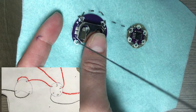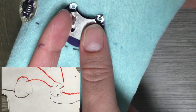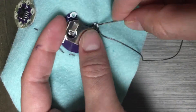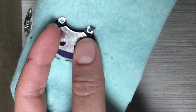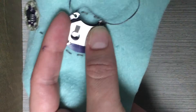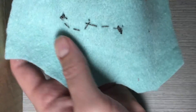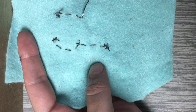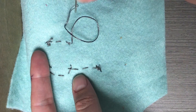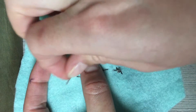Next, look at your circuit diagram — it's a good time to sew on the negative ends of the battery pack. In my diagram, the battery pack is not directly connected to the microcontroller on the negatives because I'm including a switch. So I'll sew down the negatives of the battery pack and tie off: three stitches in the first terminal, then several little stitches across the fabric to the second terminal, and three more stitches on the second terminal. On the back, you can see the positive and negative stitches clearly, not touching or interacting — no shorts. If your circuit diagram indicates you are connecting the negatives of the battery pack to the negative of the microcontroller, continue sewing directly over; otherwise, tie off.